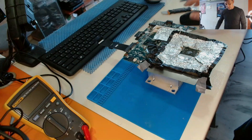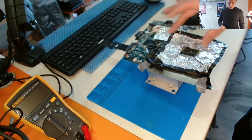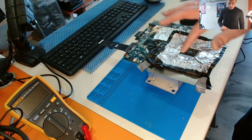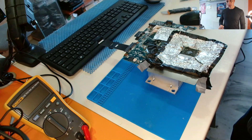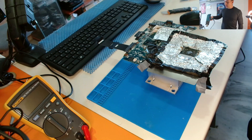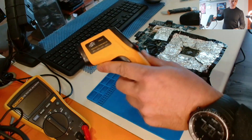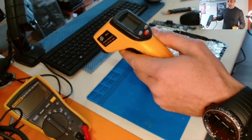We have protected as much as we can the surrounding area of the chip — some plastic connectors, the CPU, the memory modules, everything is protected. We're going to use a strong 2000-watt heat gun from a distance of at least 20 centimeters away from the chip. We'll monitor the temperature with an infrared temperature tool. Let's proceed.